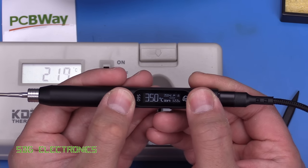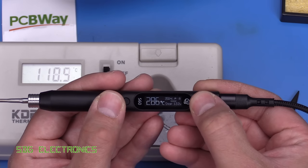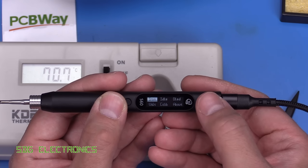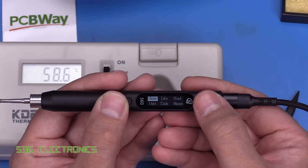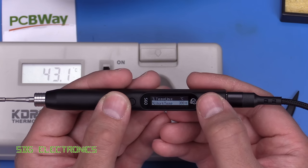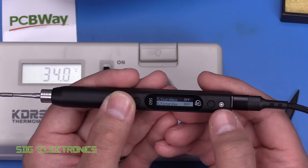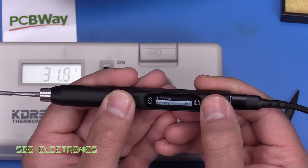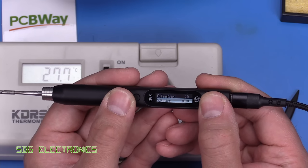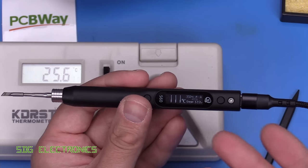To get to the user menu, you hold down the button for two seconds. The menu items are separated into groups: iron, idle (standby), OLED (display settings), voltage, and so on — quite sensibly organized. You scroll with the two buttons and hold the right button to enter a submenu. Settings include buzzer on/off, degrees C/F, working temperature on power-up (300°C), factory reset, temperature shield, step size, power limit, display brightness, and more. The user manual covers all the details anyway.